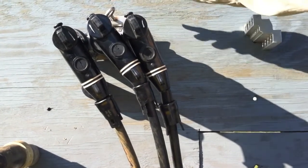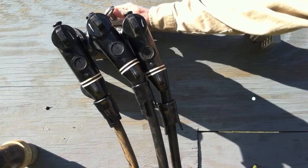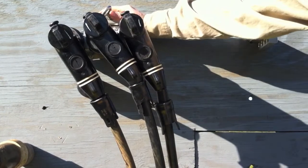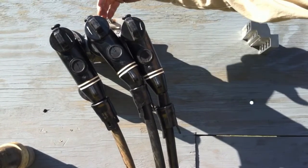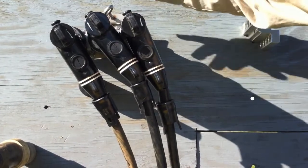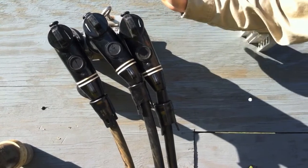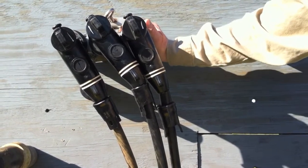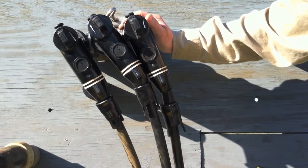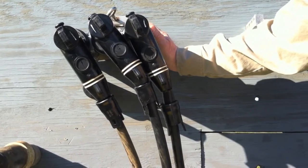But here you could just buy a 3-bushing 3-phase pad mount transformer using the adjustable junction, just adding 3 extra standoffs in it, and you'd feed in through the junction, feed out through the junction, and pigtail over to your transformer, the same method. If you burn up the elbow again and you burn up the junction, all you do is change out the junction and the elbow. You don't damage your transformer this way. And like I said, adding the lightning arrestor protection is a good thing also.